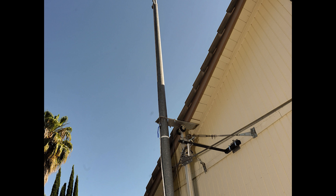The other motor will lean the tower over. There's a vertical section that's fixed to the house at about 10 feet that has a line that goes over, and I can lower the tower. Basically it's like a block and tackle — a couple of pulleys — and that'll give me some advantage in raising and lowering the tower, because you can imagine when it gets to a certain point there's a lot of pull involved. Let's go take a look at it before it gets to be really hot today.